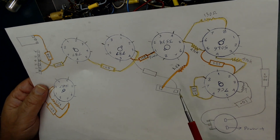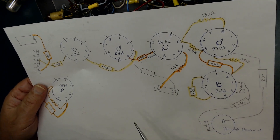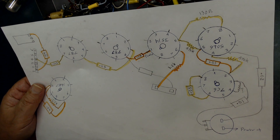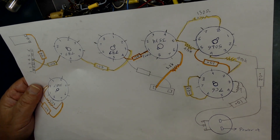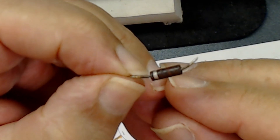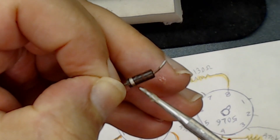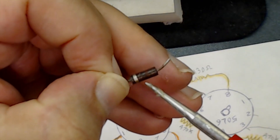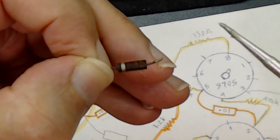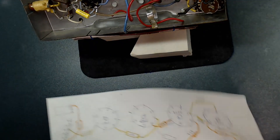The majority of these resistors have faded colors — it's so hard to see. Each of them I had to go to the schematic to track it down and make sure they are the right value. This is a good example: the colors were all faded and I thought it was just 120 ohm, but after looking through the schematic I saw it's 1.2k, not 120 ohm. The resistor was totally faded and so hard to read. I knew the first band was brown, the second was red, but the third I wasn't sure — I thought it was brown but it's supposed to be red.